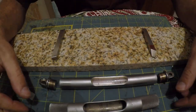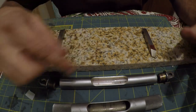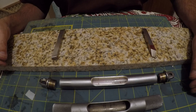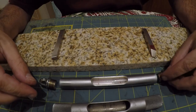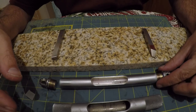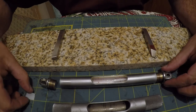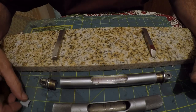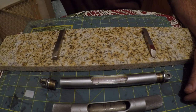It's the next day and the plaster on both sides is all set up now. For the second mix I put a little bit less flour — maybe a quarter flour and 75% Durham's putty — and that seemed to set a little bit faster.